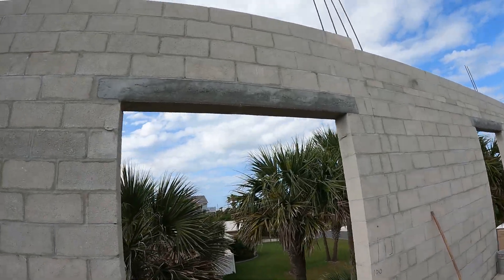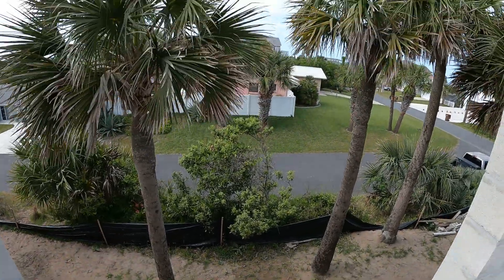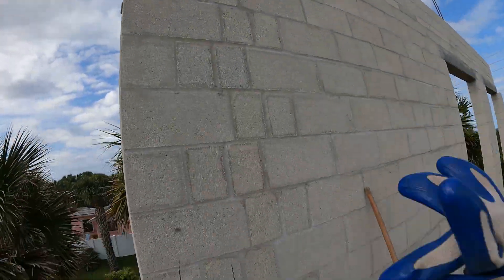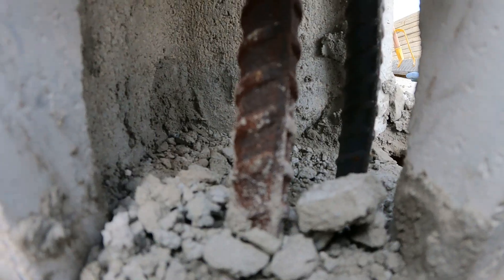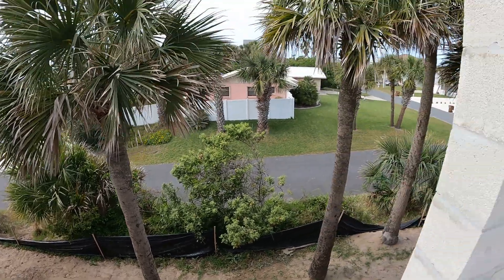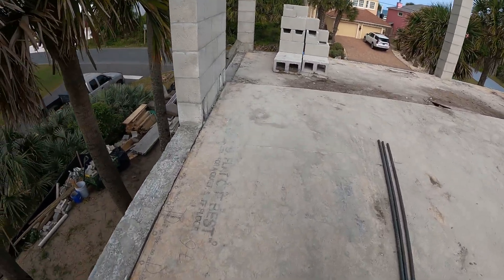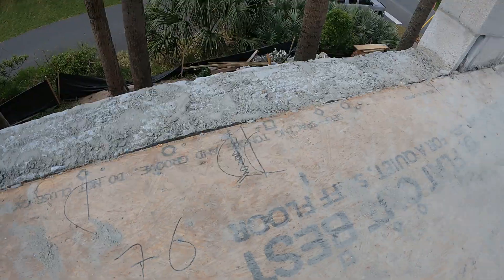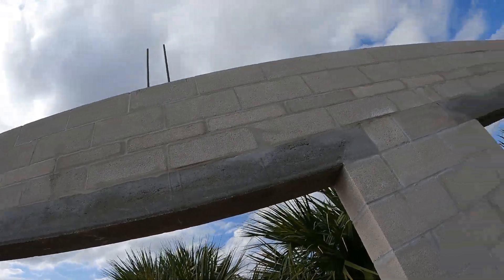Here's another big opening here. We have 100 inches, 76 on the ground. We got the center point that marks the center of this rough opening here. We got rebar that comes down to hit the rough openings — you can see it. These are not set yet; they need rebar on the bottom here, but they just laid them out. Same thing on this side — we got 76, marked with 100 inches, and we got rebar coming in the top, tied down to the bottom there.